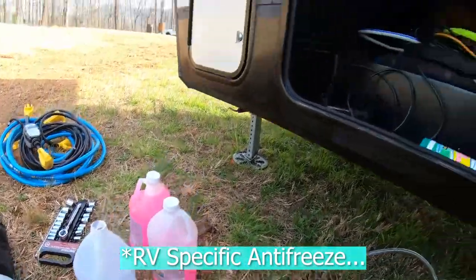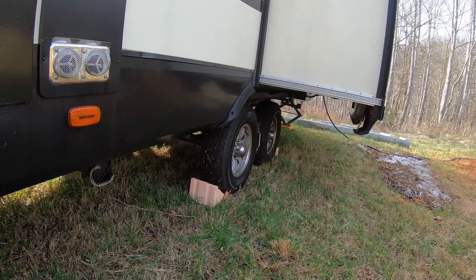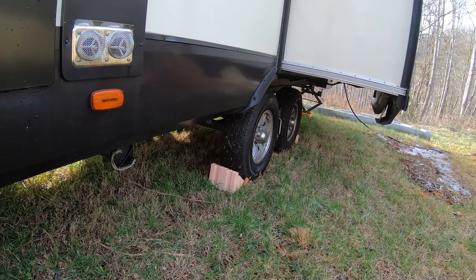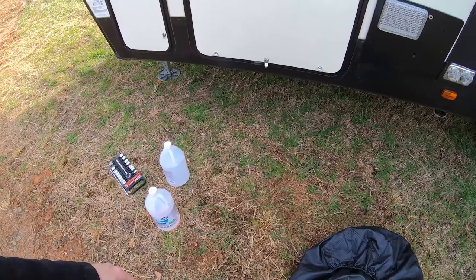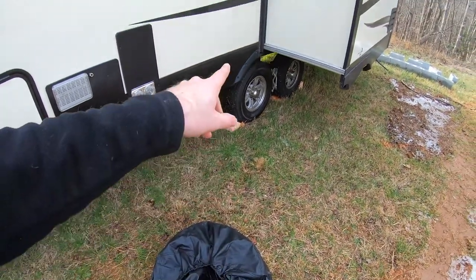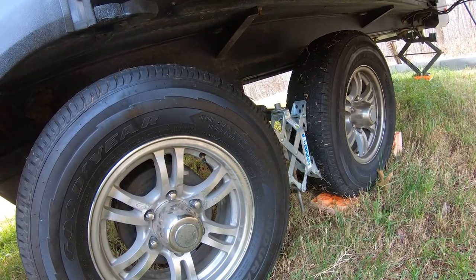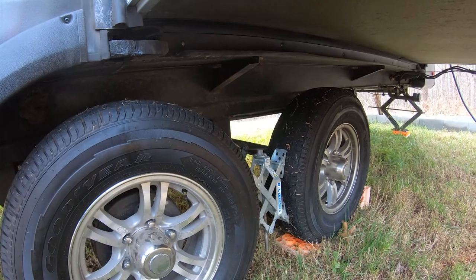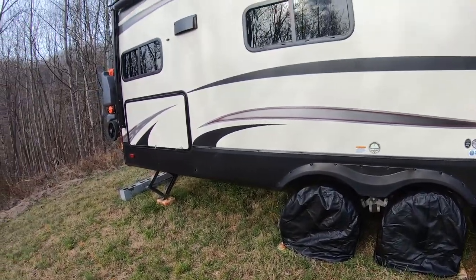For me that took about two and a half gallons of antifreeze — just got it from Walmart, and that got her done. One more thing I am going to do, even though we're probably going to move this RV sooner rather than later, is just put the wheel covers on as well to protect from UV light. If you're going to have your RV sitting somewhere for a long time, that's always a good idea to protect those tires. I'll put links to everything I used in the description below. But make sure you measure your wheel covers — don't use the exact ones I have unless you have the exact same tires. I have ST-225-75R15s, so if you have something of that size or smaller, they should be able to fit on yours. Definitely make sure you measure your tires first.